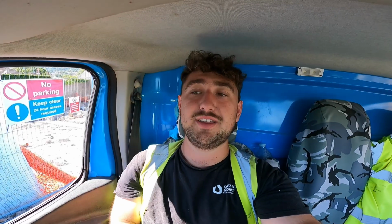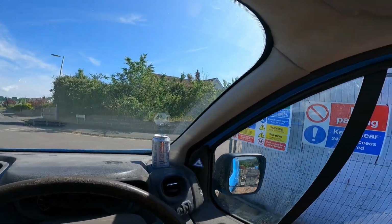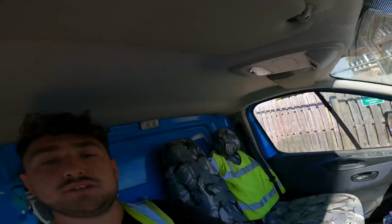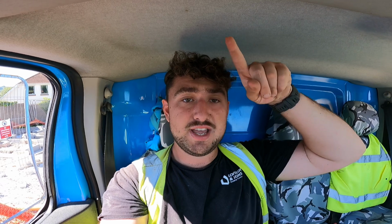So we are back Thursday morning now, and it is another scorcher. Perfect day for building. So this morning we had to do a small alteration to some of the lintels on the far side, which Matt's taken care of, and I've just gone around, bonded out all of the corners for the 4-inch internal block work for the beams to bear on.